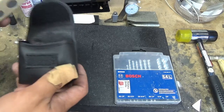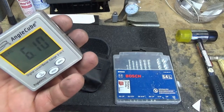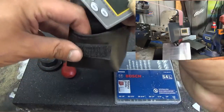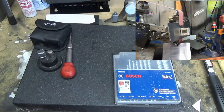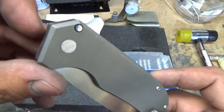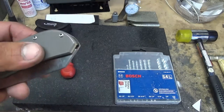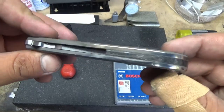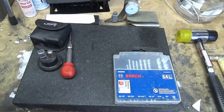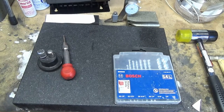In here we've got an angle cube. You might be asking what you use this for if you grind freehand. This tells you what angle something is depending on its tilt — I use it when I set up a work rest. If I want to contour handles and get a consistent contour on tiny little angles, I can set the work rest to, say, 30 degrees and get that angle. I still have to control my pressure, but I get a consistent angle that way. I use this occasionally — it's a nice-to-have. I don't use it to set bevels; that's all by eye.